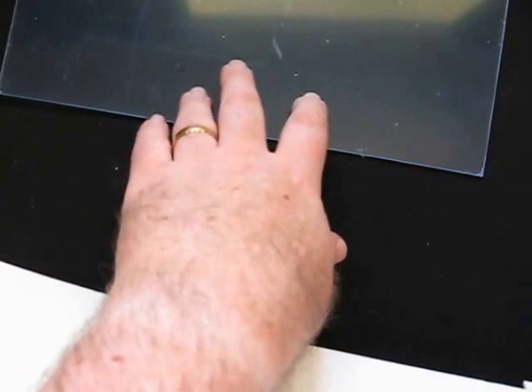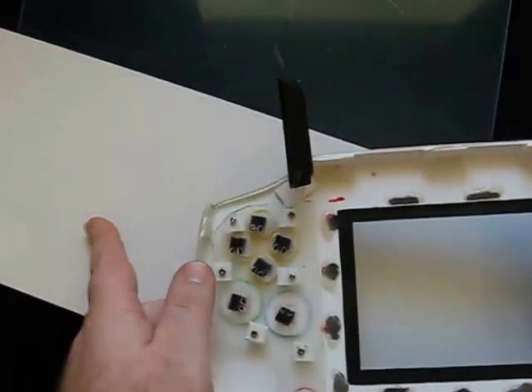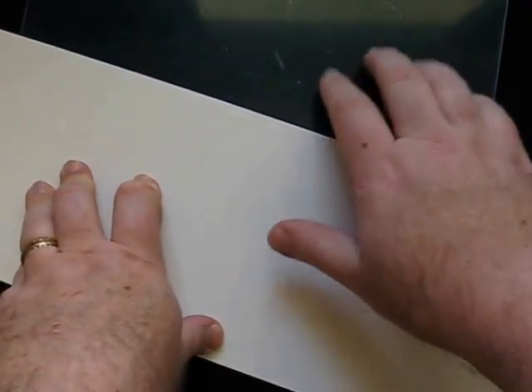Regarding plastics, there are two types I find useful. One is plastic card, also called styrene — this is 2mm thick, ideal for vacuum forming, and also a very good general-purpose plastic because it's strong, flat, and if you score it, it's very easy to break, making it very adaptable. The other material is Perspex, which is clearer and was highlighted earlier for mounting buttons, because it's easier to see what you're doing with a transparent surface. However, Perspex is much harder to cut with a Dremel and much messier. Generally I use styrene, and for specific applications I use Perspex.